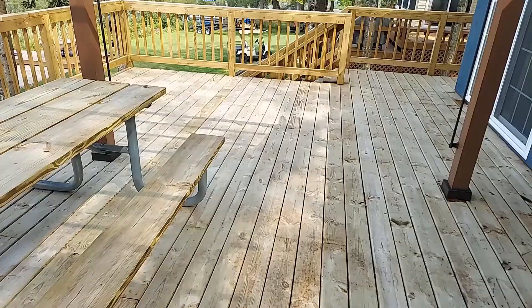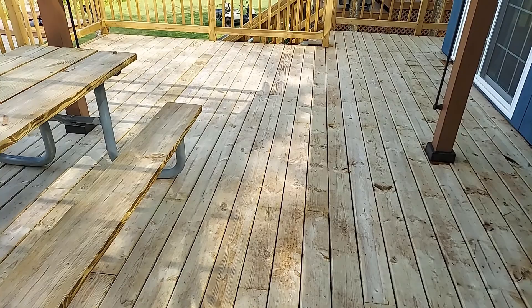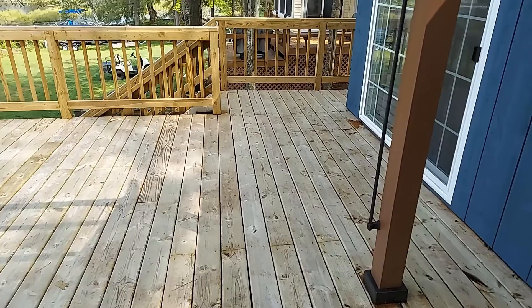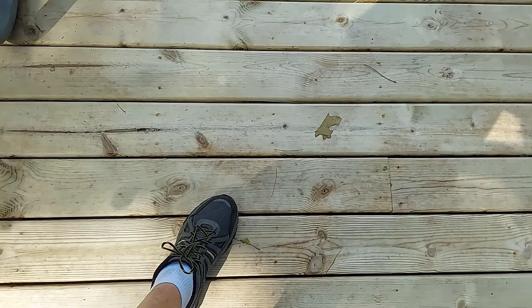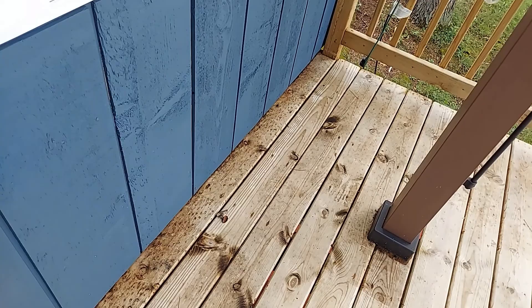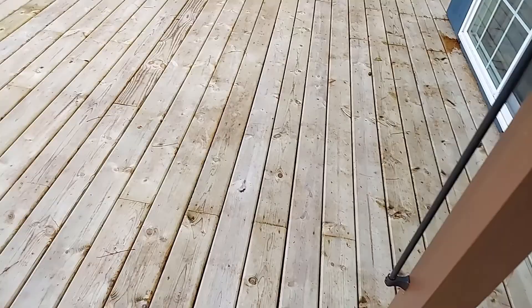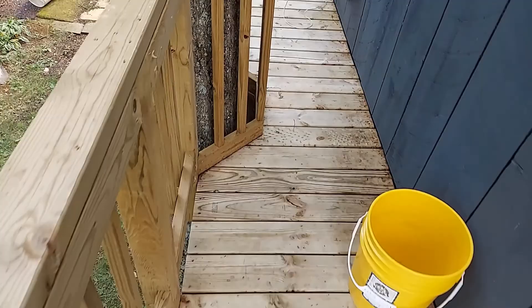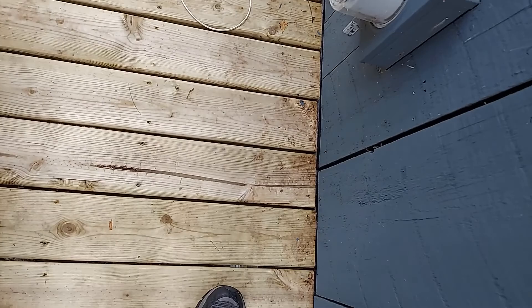It's been about 24 hours since I finished cleaning the deck. I've rinsed it twice and I'm pretty happy with the results. Obviously, because there was bleach involved mixed with the TSP, we have lightened the wood a little bit. Let's take a look at that spot where all the bad staining was — right there. As you can see, there is still some staining that exists, and there's some staining in a few places on the surface of the deck. There's just not a lot that can be done about it — it really needed a miracle after what happened. All in all I'm happy with it — good enough to get a sealer on it. The walkway cleaned up good, though I still have some staining along here.